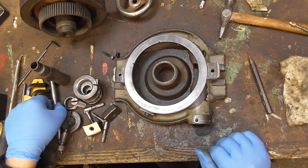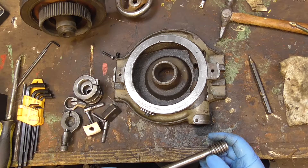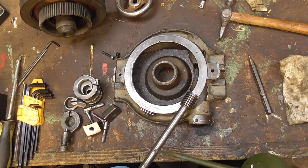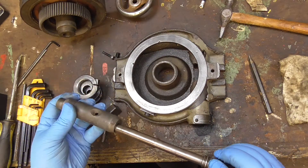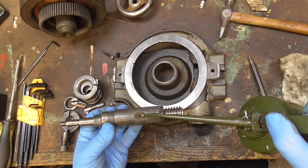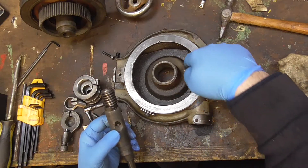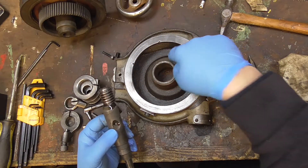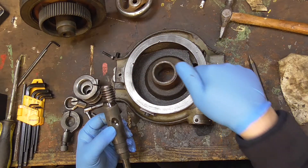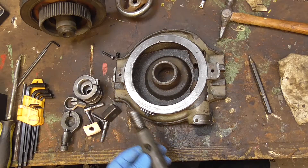Right, so we're assembling everything and it's going to be a light oil up and put together. I'm just using a very light machine oil. One thing I'd note while I'm doing this is the inside of this was really thick with crap and dirt, and there's still little bits of flakes of metal in there. I would have thought there'd be a drain in this so anything that got in there could just run out, but of course oil from lubrication is never going to be able to get out — it's going to pool in there and go horrible and gungy.